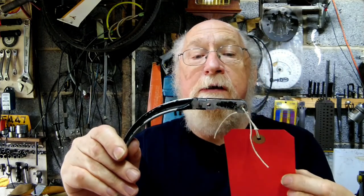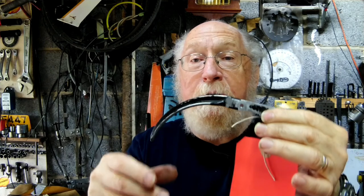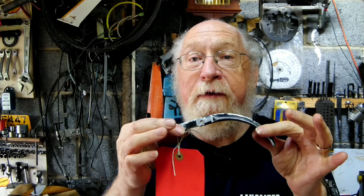I've just done this — this is a handbrake lever off Just Jane. It's the pilot's handbrake on the column, and he squeezes it like a bike brake lever. You squeeze the brake and he puts the brakes on. And according to where his feet are on the pedals — whether he's pushing port or starboard — it depends on the differential brakes. This can also be locked on as the handbrake.